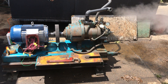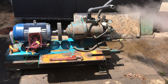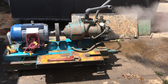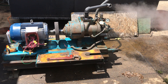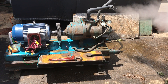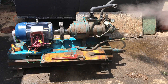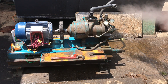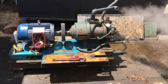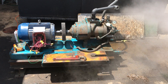What we've done here is we have converted an old screw compressor and repurposed it. It used to be a 50 horsepower air end. We have added a few things to it and made a few modifications. We'll be eventually placing the outlet under a vacuum and recycling the steam, but at the moment we're running this with only about 10 or 15 psi.